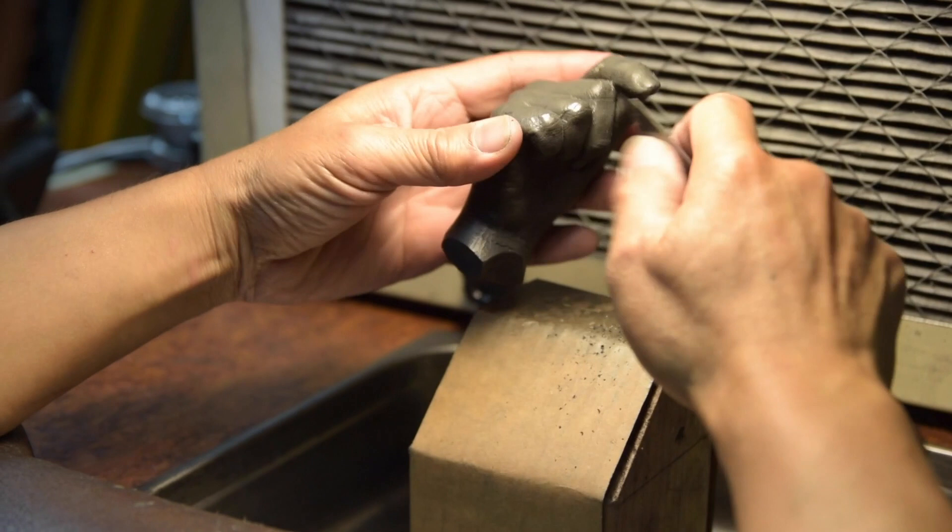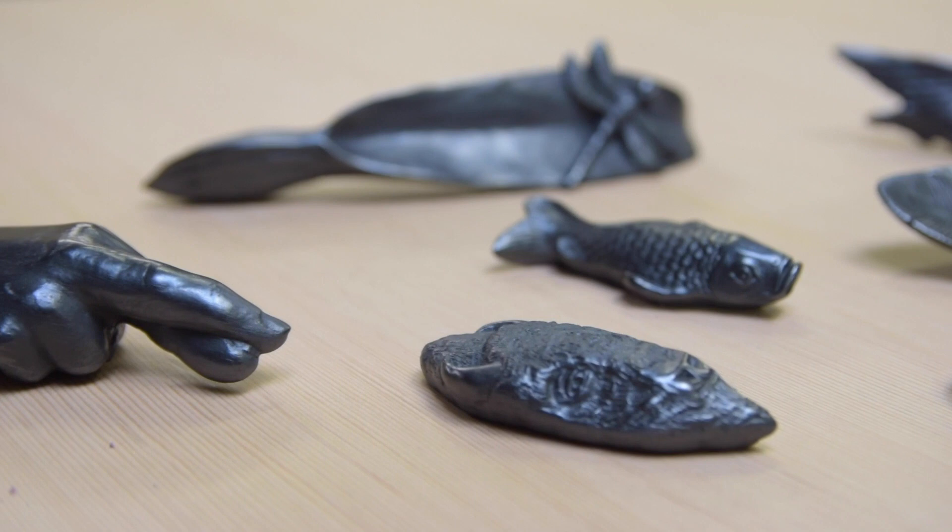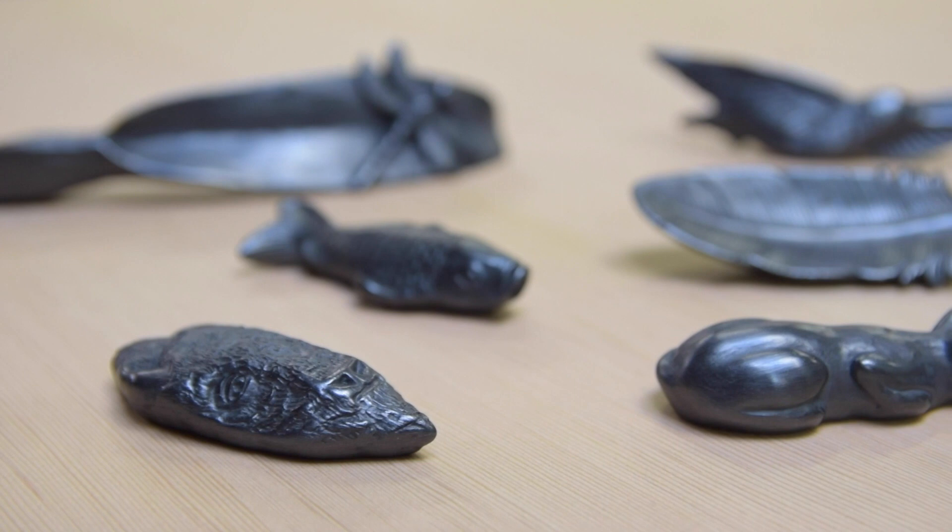I get that mold back, and I press a special formula of graphite in it at very high pressure, take it out, and then I carve down the seam lines — or chase the seams — and then I polish it up in a traditional polishing method.